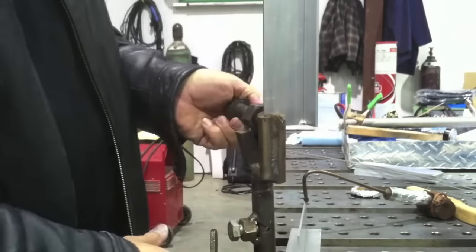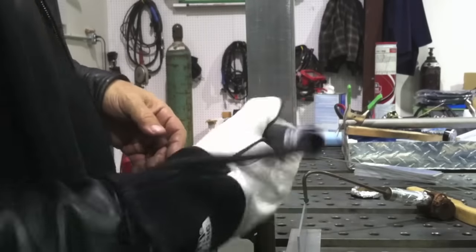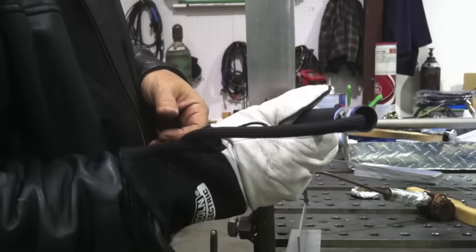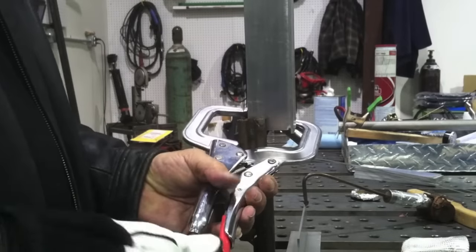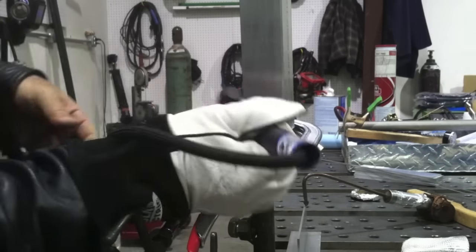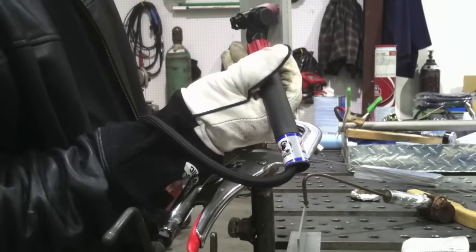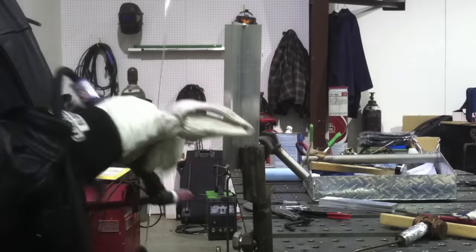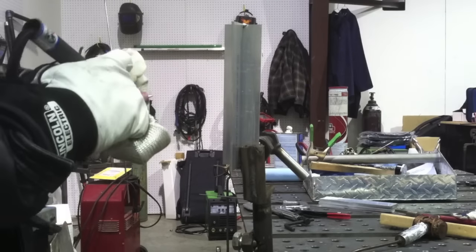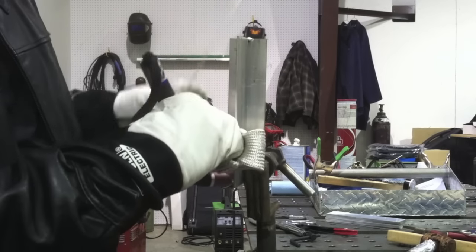I've got this little homemade apparatus where I can clamp pieces at different heights to weld and film. I'm going to put the piece up there and take a few dry runs to figure out the best way to prop — there are lots of different ways. One way is to clamp something to prop your hand on; I've got a little C-tong type clamp from Strong Hand Tools. One way to prop is just carry a prop in your pocket like I do — I've always got a TIG finger in my pocket and it lets me slide up the whole joint without going to great lengths to find a place to prop.